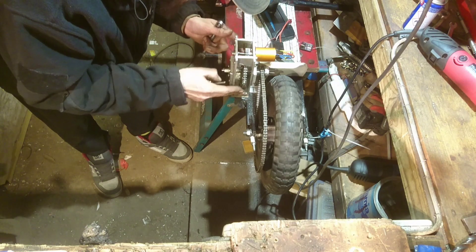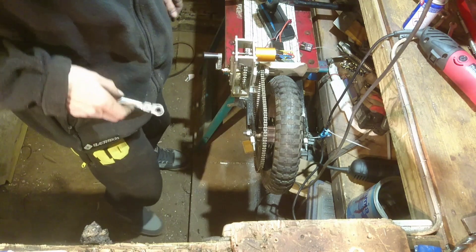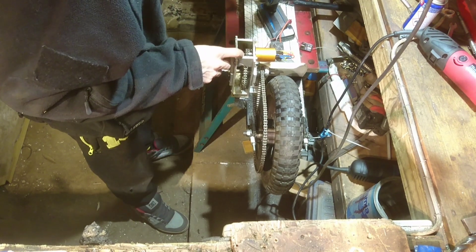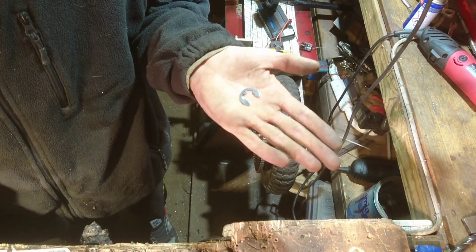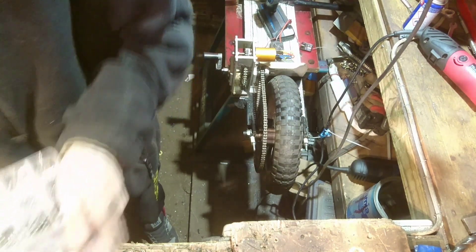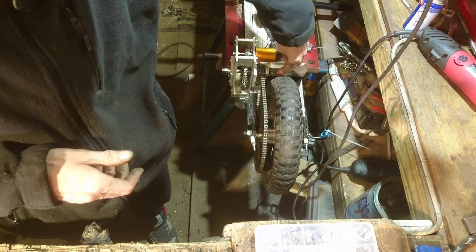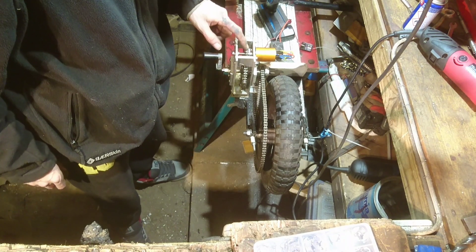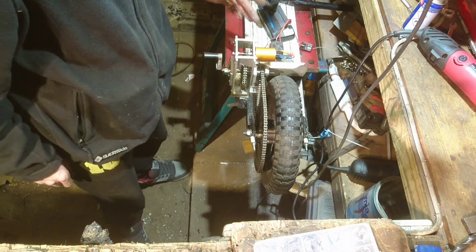My chain is a little bit loose, I'm not going to lie. It should be fine - it's got the tendency to fling itself off a bit more but I can go with that. That gear is knocked on there quite hard and it's not pulling that way anymore. I mean these circlip things - I've got all different sizes. We're probably going to keep using one of them on the end of the shaft just to stop it going that way - a little piece of bar in, cut a groove and slap one over and it should hold it all. That looks like it's back together for the moment.